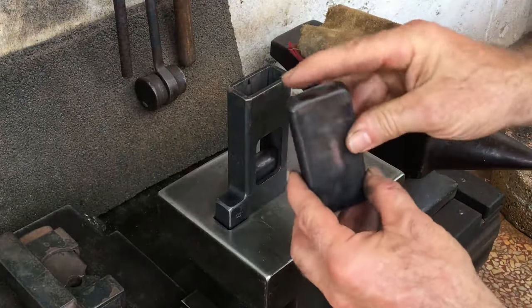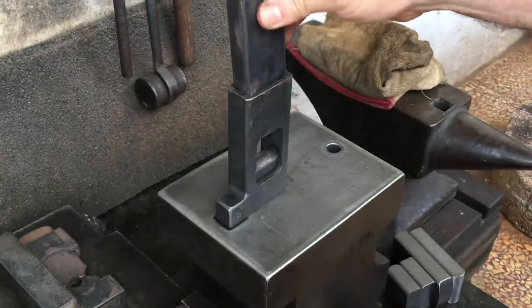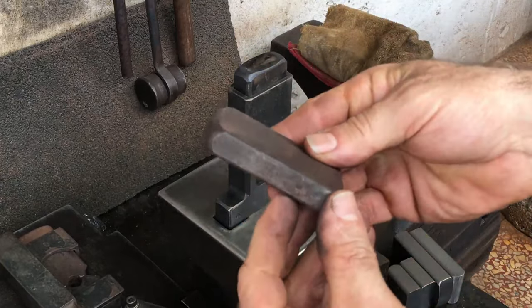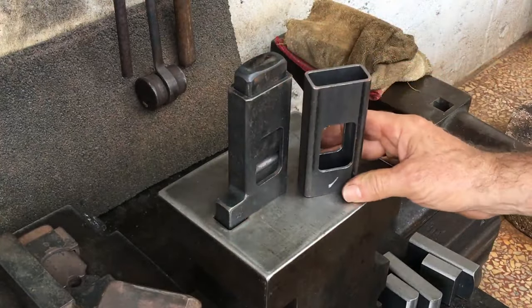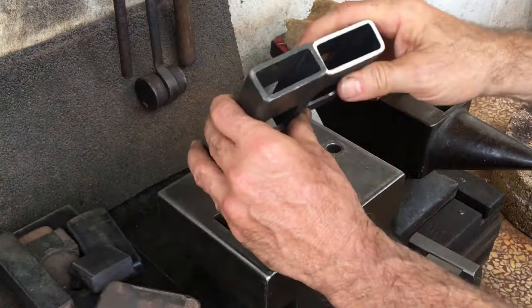I use 1050 medium carbon for the dies, and I've noticed over the years there's a lot of inconsistency. The die in the tube guillotine version has mushroomed pretty badly, whereas the one I've used much longer hasn't shown any wear or tear. The new tubing is just a little bit thinner with a larger interior size, so the dies are bigger.